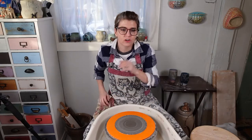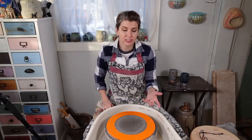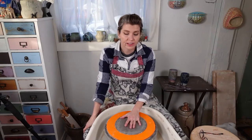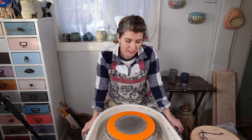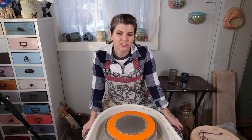Do you need to wear a mask when grinding? No, because this is wet — you see all the water we're putting on here, there's zero dust, no dust at all. If you were grinding in a dry situation, yes, but you should never do that — always wet grind. These are diamond grinding discs so it's best to grind wet, and it's better for your health. I think it actually grinds better when it's wet too.